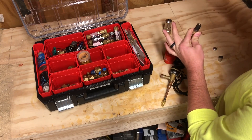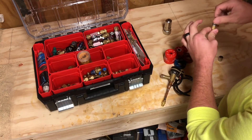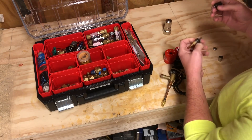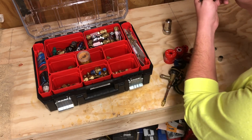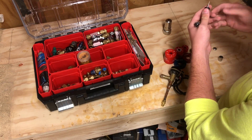clockwise it's fully closed — no refrigerant should be passing through in the fully closed position. If you wanted to open it, you would turn it counterclockwise. I can pull the magnet all the way out of here, and you're going to notice there's a stem on the end.